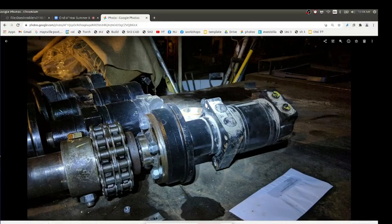There's a four-bolt flange with about four and an eighth inch spacing using half-inch bolts — that's how we mount it. It's a bit inconvenient because the shredder starts right here, so you've got to go all the way back to mount it. These are off-the-shelf parts. In an ideal motor configuration you wouldn't have this weird coupler, but this motor came off a wheel motor application and they don't really have standard couplers for it — they have wheel mounting plates. So we had to make up this whole contraption, mounting the double chain coupler as if it were a wheel structure with five lug bolts. It's a half-inch plate with lug bolts, a two-inch shaft goes through, and this coupler has a little play — like a chain coupler — so it's not stiff.